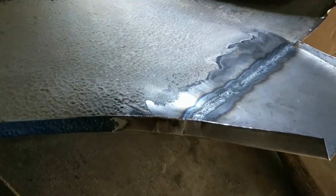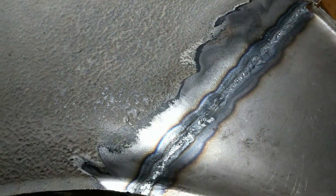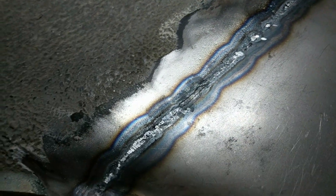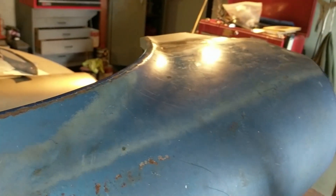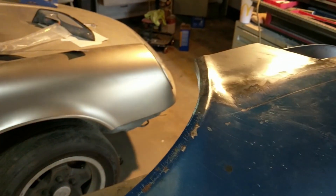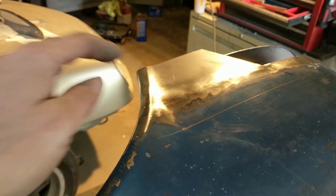Here's the back side. I just lightly ground a few places where the weld came too far through, but it's welded all the way solid with no holes. I'll put a big bright light up — it's difficult to see reflections on unpainted steel, but if the light is right you can see how the metal reflects. To my eye, the distortions are largely gone. I've done some hammering on this so it's pretty well done. I still have to trim the flange and tie it in, but the difficult part — the outer weld — is complete.